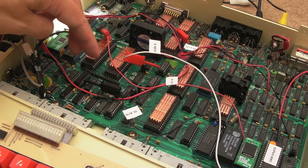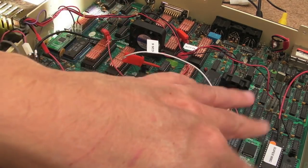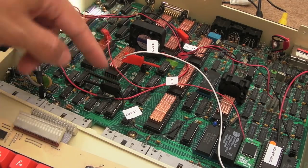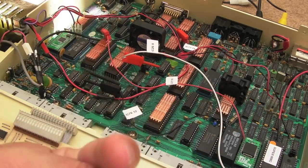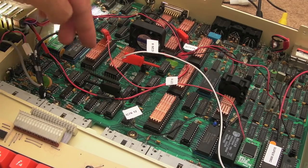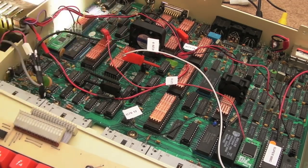The other thing I'd point out here is that in a lot of these, the keyboards have been in and out, in and out, as people have dealt with ROMs, swapped ROMs over, or other mods. And the pins there can be higgledy-piggledy. Mine were all over the place. I had one like that, one like that, one like that. They were really badly mangled. So I spent some time with fine nose pliers straightening them all out a number of times, actually.